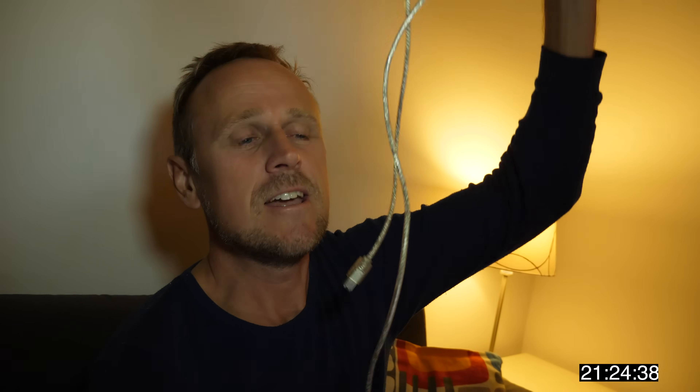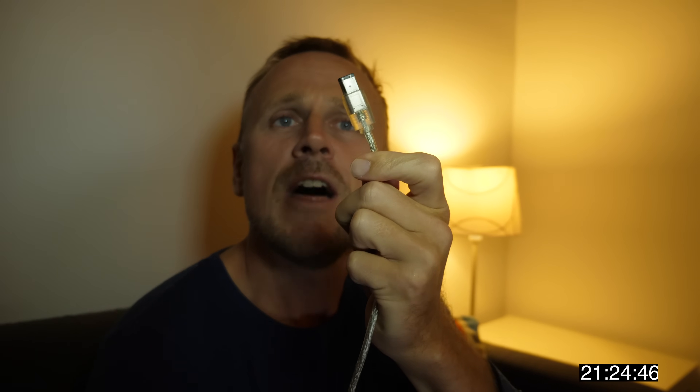What you're gonna need is a Firewire cable, this guy here. Firewire back in the day was called Firewire 400 — 400 megabits a second throughput. That there is a 6-pin Firewire 400; on the other end of the cable is a 4-pin. The 4-pin was what went into the camera, the 6-pin was what typically went into a computer — generally that came with Apple G4s, G5s, the cheese grater ones.